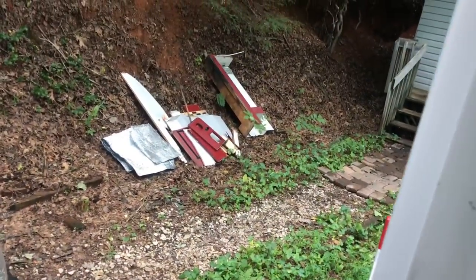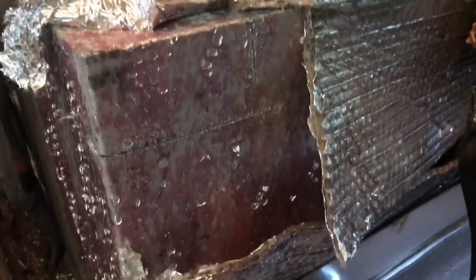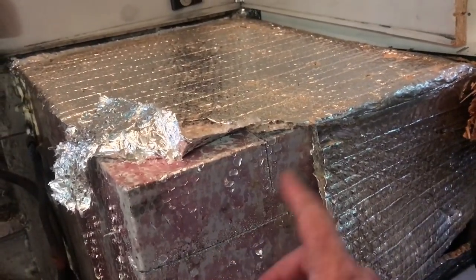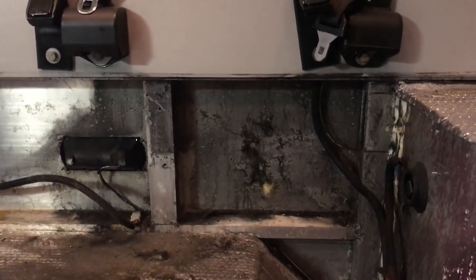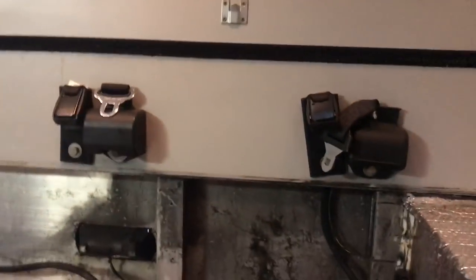I have a pile outside and that was going good until I got to the first box. I thought these were fiberglass — if they were fiberglass this would have been a piece of cake to cut them out. The good news is it's very strong, very tough stuff, but you just have to cut and pull. Then I tried to saw with a metal blade and it just ate up the blade. I found out there is a long-term leak in the wall. They have a nice thick batt fiberglass insulation, so I took that out because it was wet. The plywood is of such good quality that it never discolored — that's what confirmed it is marine grade.